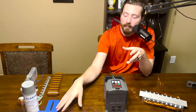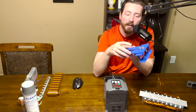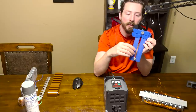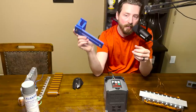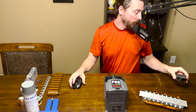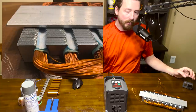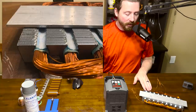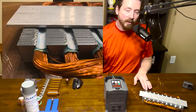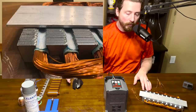That tool could use some serious work - I would probably not make this first piece move at all, and I'd make this piece a captive bolt system, because right now if you pull the two pieces apart the bolt will just move all over the place. But it was a great first attempt. The blue paper you see near the coils is Nomex paper - a really high temperature paper. Since those coils were vibrating all over the place, if they were just allowed to touch the metal they would rub off their coating very quickly, so we use insulation paper to keep them from rubbing against the metal. It also won't catch on fire as the coils get very warm while they're in the motor.